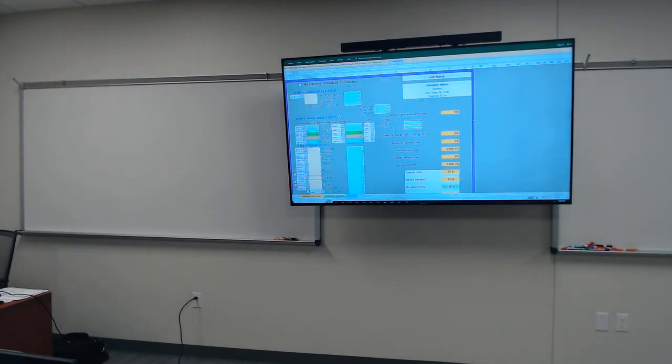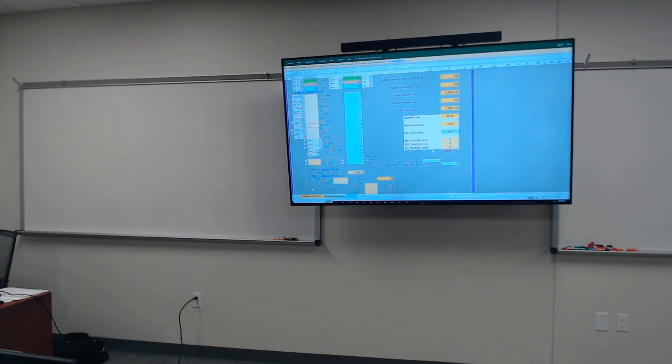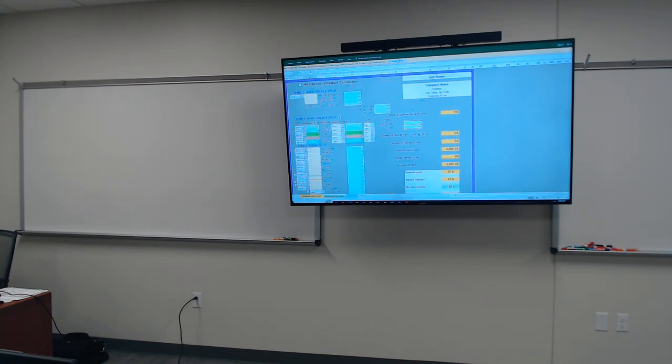It does the same thing as the other one showed you, all right? But yeah, this right here is basically put in the square footage of your home. It'll tell you what article, 220.42. 220 is load calculation on residential, churches, elementary school, whatever you have, all right? But our project is going to be based on a residential home, all right?